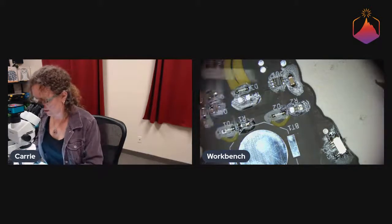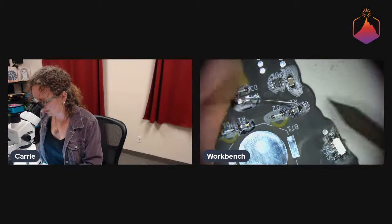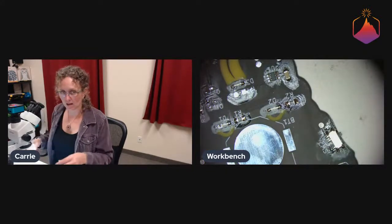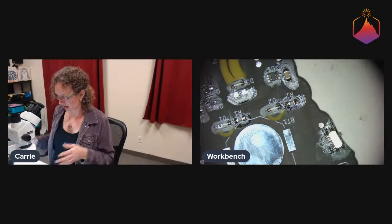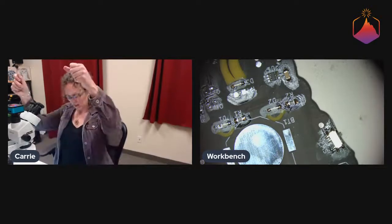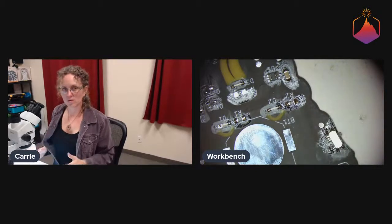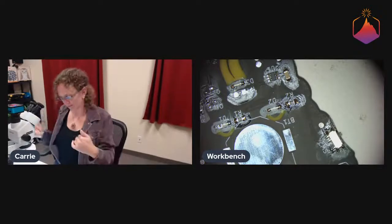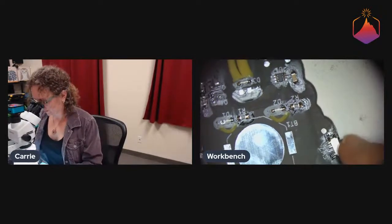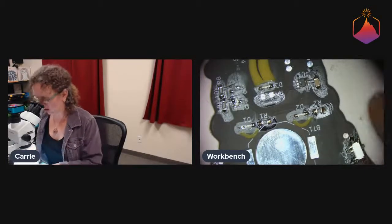It has nice little fixturing tools and pegs, so that the pegs key into holes in your circuit board panel. So you can just put the circuit board in, pull the stencil down, squeegee all your solder paste through, lift the stencil up, take the board out, put the next board in, repeat. Then you just hand place all the components and put it through the oven.